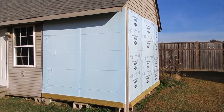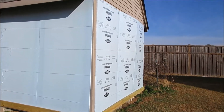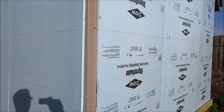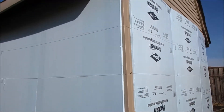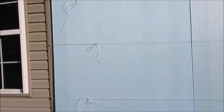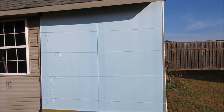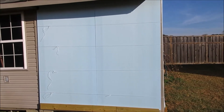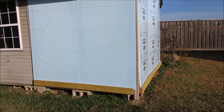On the outside you can see I've got foam insulation — it's Dow three-quarter inch — tied up with tomato twine. There are four different lines, and I wrap the tomato twine around and tie it with a trucker's hitch. I'm doing this instead of a plastic double layer inside because when I take the foam off, the clear polycarbonate allows a lot more sun in.